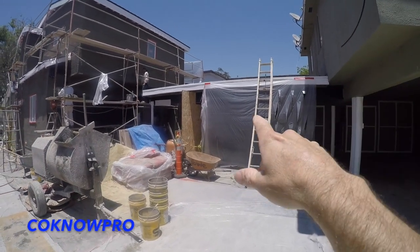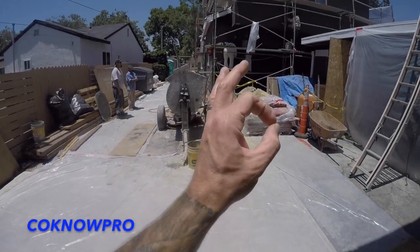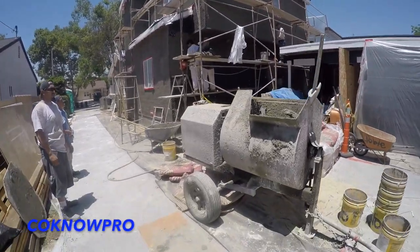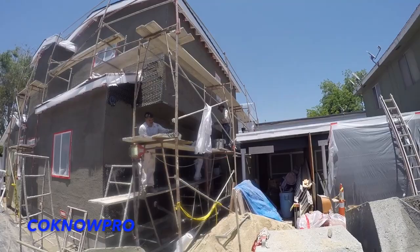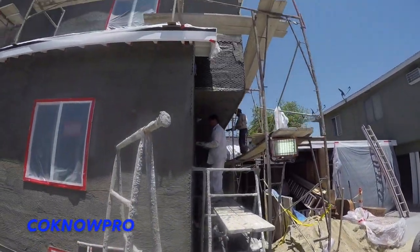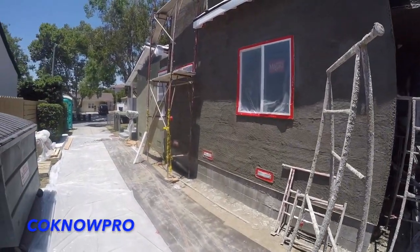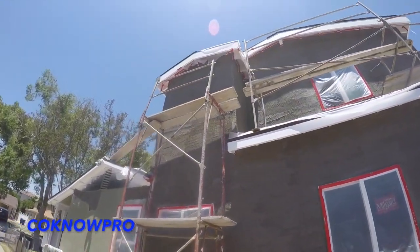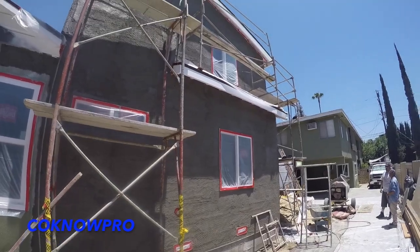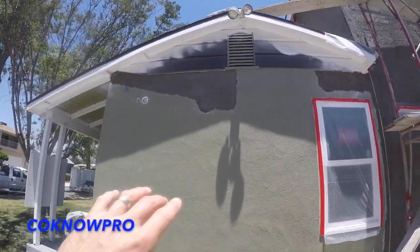Look at this — professional work, plastic down to protect the surface. Here's a must-know tip regarding exterior plaster and stucco: after your lath is finished, before they scratch or brown coat, you want the roof completely roofed off — or at minimum papered with all roofing material stacked so the weight bears down on the framing. Then have your interior drywall installed so that weight bears down on the structure. Then scratch and brown coat the stucco. Doing it in this sequence will basically eliminate cracks.